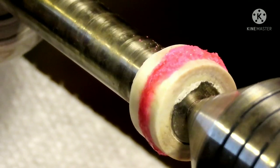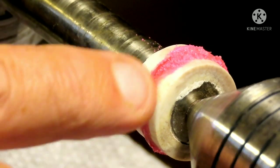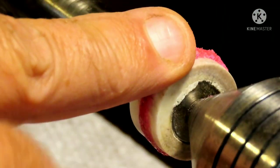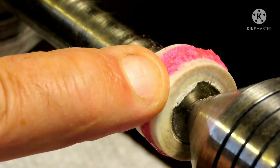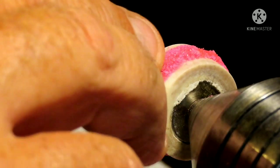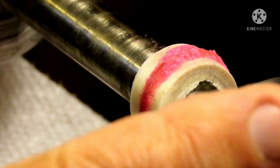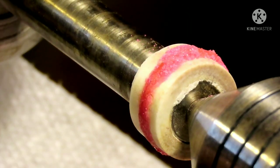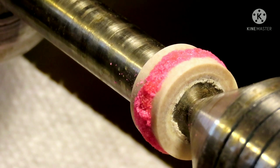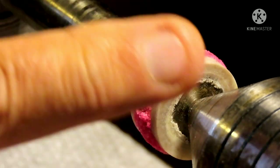Keep your inlay material very close by because it'll start to smoke if you get a certain mixture of air and dust. I've used sawdust for inlays, baking soda for inlays, copper for inlays — but with sand and stone you can't use your tools to cut it; sandpaper or grinding wheels are the only way to get it off. Pile the inlay material on, tap it and tap it and tap it. Put that smoke out as soon as possible because it will burn the material and change the color, so you've got to hurry — especially with something light-colored.